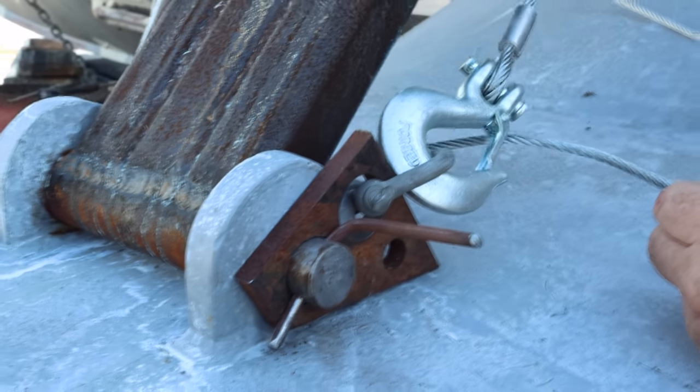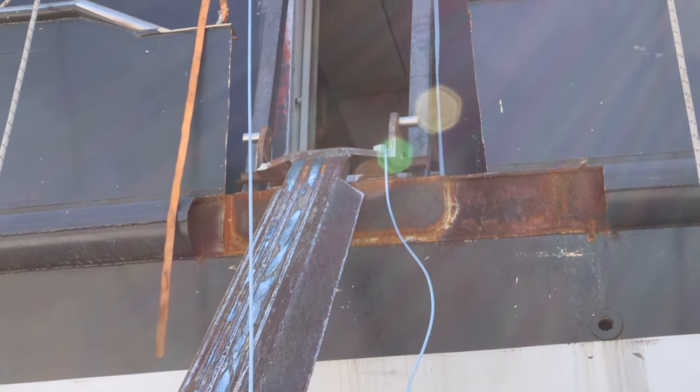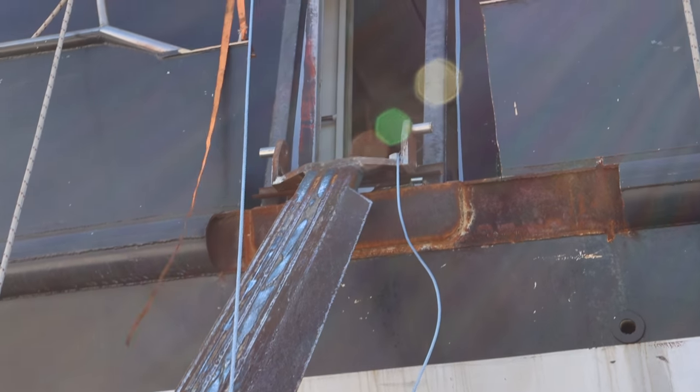And that means that we're lifting from the stainless pin that the arm is normally held from. The reason we want to lift from here rather than our normal spot down on the end of the wing down here is because we can get the cable underneath the arm up the top there. So as we lift it, the cable, at the moment you can sort of see it's going over top of the arm, so we physically can't lift it. Whereas by doing this, we can swap the cable underneath.